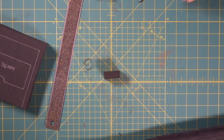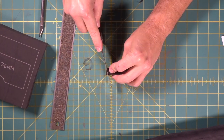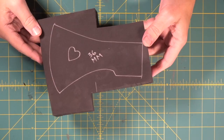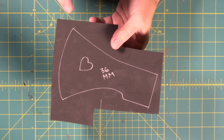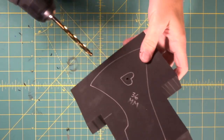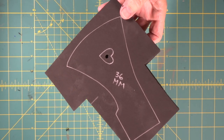Now we're going to do a side cut, so we're going to come in here, take our side cut pattern — just like that. Now we've got an angled front. Here's our 36 millimeter blade. Now we're going to use a drill bit to poke a hole through the heart right there so that we've got a hole to feed our scroll saw blade through to cut the heart out. Now we're going to go through with a wider bit just to make the hole a little wider — perfect hole. Let's go feed the scroll saw blade through there and cut it out.